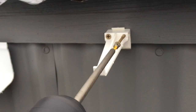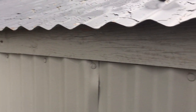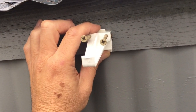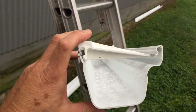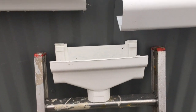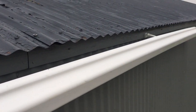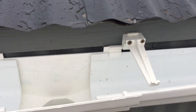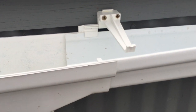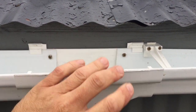And this is why we need the long screwdriver. That's going to be my low point, so my next one is actually five feet over and a quarter inch up. The brackets snap into the gutters here and here. I'm going to install this dropout right here, so I've temporarily got this next piece just hanging on the brackets. This just slides in like this. Same on the other side, and then I'll just pop this bracket in. And I screwed that to the wall here and here for extra support.